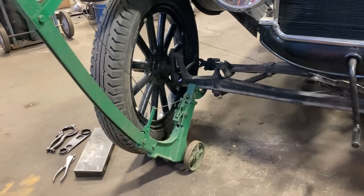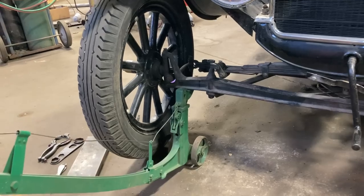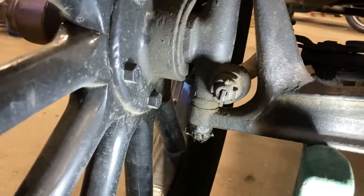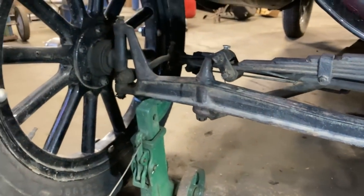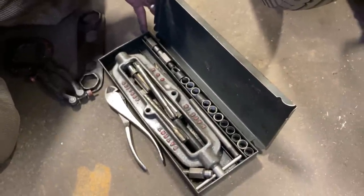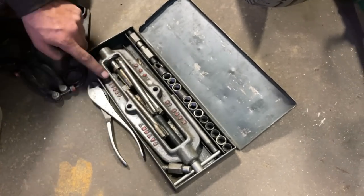It's raised to the right level, so we go ahead and do this. When the wheel turns, the entire kingpin is doing this as it moves — those threads are now gone, they're oval now. What do we do? Do we go to our parts book, look up the part number for the front axle, and perhaps bring one in through the dealership? Or Stevens — Stevens Speed-Up Tools have made us this tool in 1925 to use on this 1925 Model T. You see these helicoils, this little tap, and this unit right here, along with this reamer, are going to save this axle.